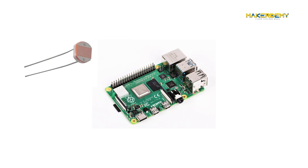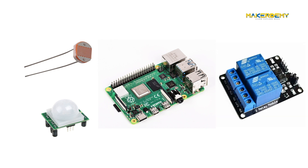I have an activity for you with the concepts we have learned. I want you to create a smart light for your backyard with a Raspberry Pi. The project will have an LDR, a PIR, and a relay. The LDR checks whether it's night or daytime by light intensity, and only if it's night and motion is detected will it make the relay switch on a CFL in your backyard. I hope you are successful with the project. If you are stuck, you can check out the resources section for the code.